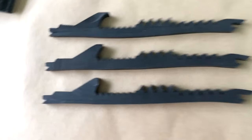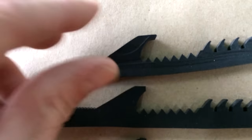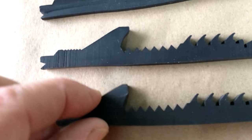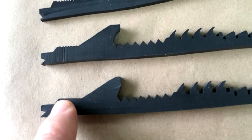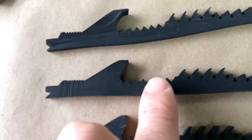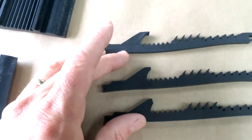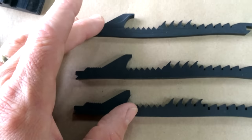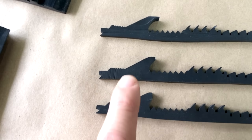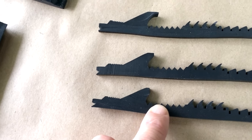Let me take this off so you can see it. There's what it normally looks like, then I've cut it down and opened it up, and cut it down and opened it up even more. Instead of being so protected down here, I've now exposed this area. So if you have a lower velocity in your sluice or lower water, you can actually trim that scrubber mat and get more exchange.